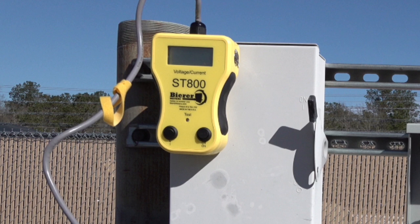This unique tool to the utility industry does two things simultaneously. First, it will test the integrity of secondary conductors and it will also identify secondary conductors, and there are a couple of applications for identifying primary conductors as well.